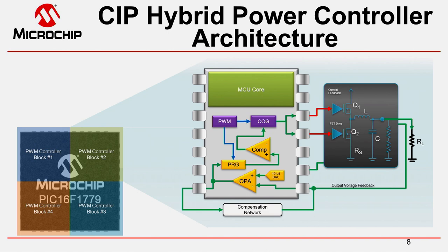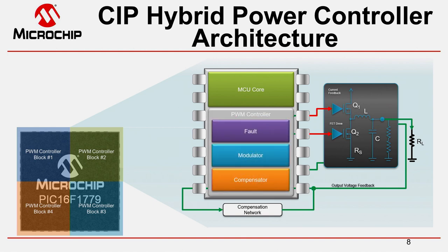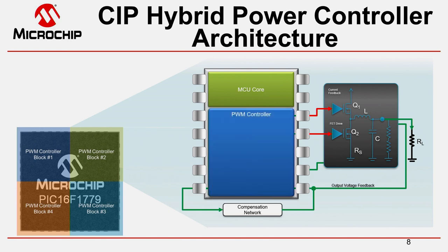When we look into the basic architecture of one of the PWM controllers supported by the MCU core, we can identify some standardized blocks. These blocks consist of a compensator — usually an error amplifier and a DAC — then modulators defined by the control mode and topology being driven, and an additional fault level. These three central building blocks are reused in every application, and together they define one PWM controller block.